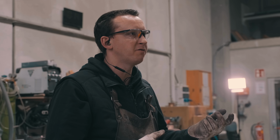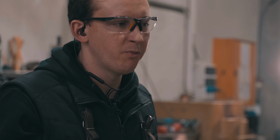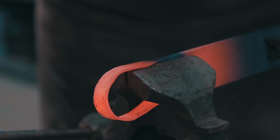One round and then we'll make the handle. You'll want to start with the complicated stuff because when you mess it up, you don't miss time forging the rest of the blade. The blade forging is easy. Not a lot of mishaps can happen there, so you want to start with the complicated part where you didn't yet invest a lot of time into the knife. So yeah, the handle is the majority of work with this one. Takes about 2 to 3 hours, I'd say, forging, and the blade is done in a few minutes, essentially.